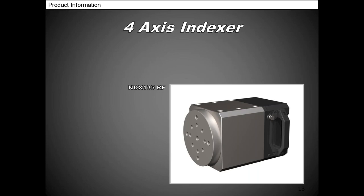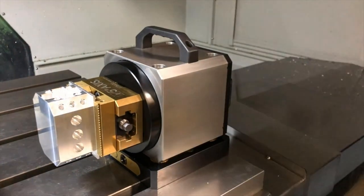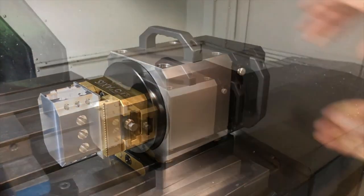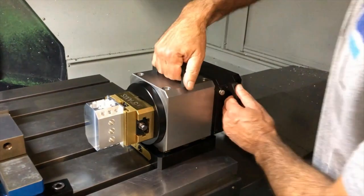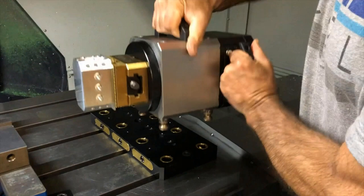You put the studs on there so you can actually have a self-centering vise on your fixture. You can change it to a collet chuck. You can change it to a dovetail. And then, hey, I want to put the KME on there. So now you can. This next slide will show you the actual unit in motion here. That's the power pack. We call that the power cell. It changes out that quickly. It's fairly light. It's a 96 millimeter center to center on the studs.